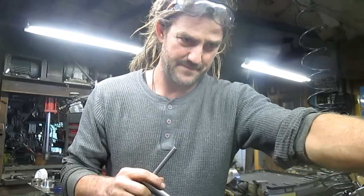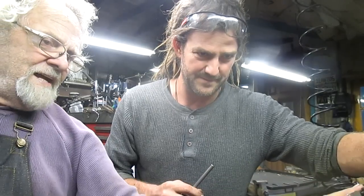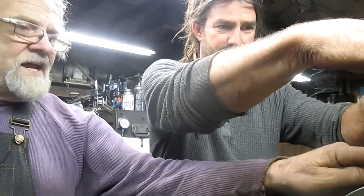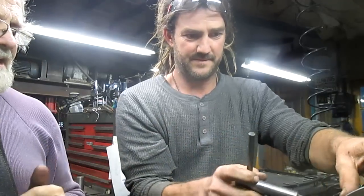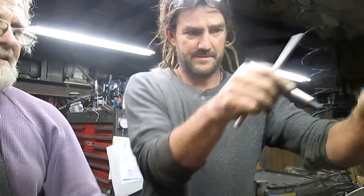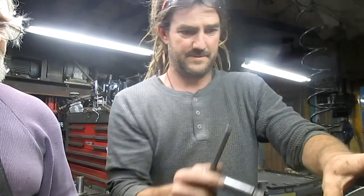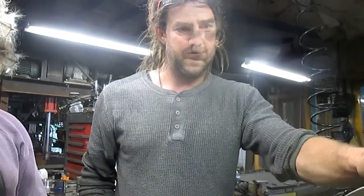Okay, so that direction is your high point. Now come to your low point and unscrew that a half a turn. Now go back to your high point, screw that in a half a turn. Come back to your low point, do that a bunch of times until you start to get it closer.